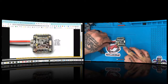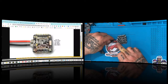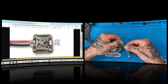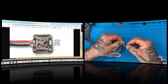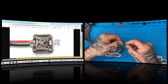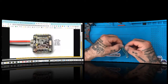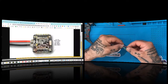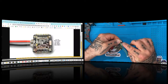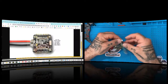If we flip our ESC over with the plug facing up — which puts our XT60 and capacitor on the table — the wiring harness tells you: red is for battery, orange is for current sensor, black is for ground, there is no fourth cable, then the fifth cable white is for ESC1/motor 1, blue is ESC2, green is ESC3, and yellow is ESC4. We don't really know if motor 1 through 4 are correct — that's what we'll test in Betaflight. What does matter is red, orange, and black. Remember that pattern — write it down.